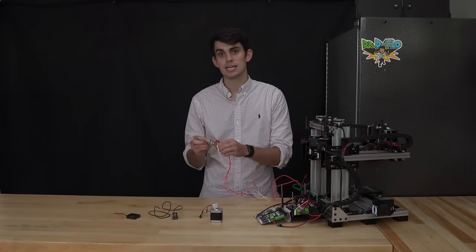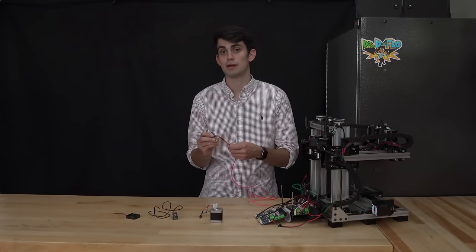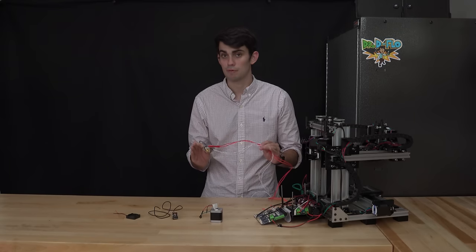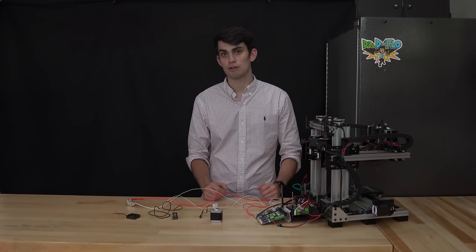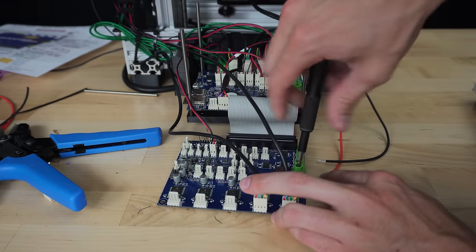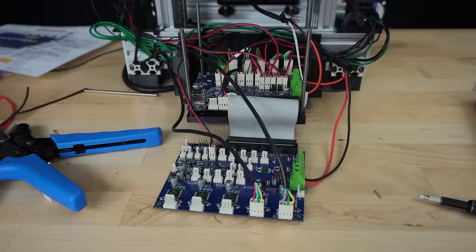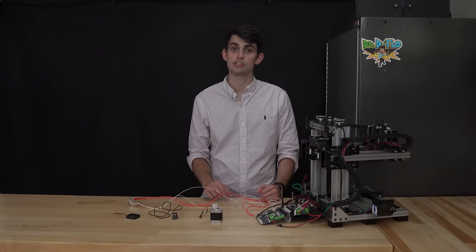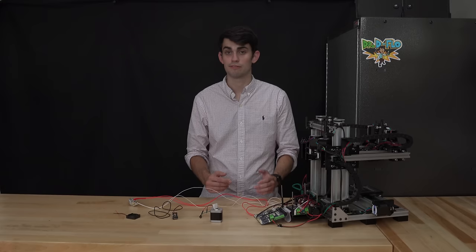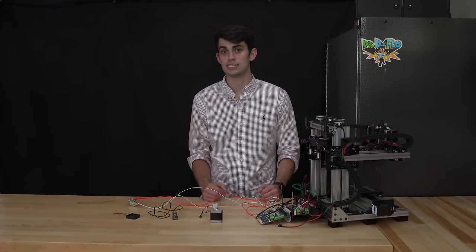Both the heating element and temperature-sensitive resistor of the extruder can be plugged into their corresponding pins in either of the two possible directions and will still operate perfectly fine. It is, however, critical to get the polarity correct for the positive and negative wires coming from the power supply. You should always reference your motherboard's wiring guide and the physical marks on the motherboard to determine which terminal on the motherboard is for the positive power input and which terminal is for the negative power input. But let's walk through the other components to determine if they are sensitive to polarity.